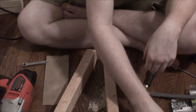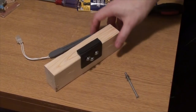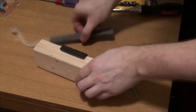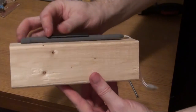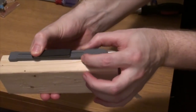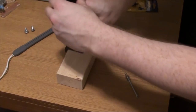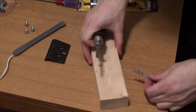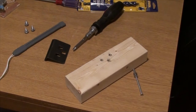At this point I had like four rejects already and had finished three, so my success-failure ratio wasn't too good. This is a failure here — you can see it does not sit level at all. If I put the sensor in, all the pressure from this perspective is going on the left side, and the right side actually has a little bit of extra wiggle room. So I'm going to have to redo that one. This was the main problem with the drilling technique I used: I had a horizontal guide but not a vertical one, so if vertically I was even just a slight bit out of alignment, the thing just would not sit flush.